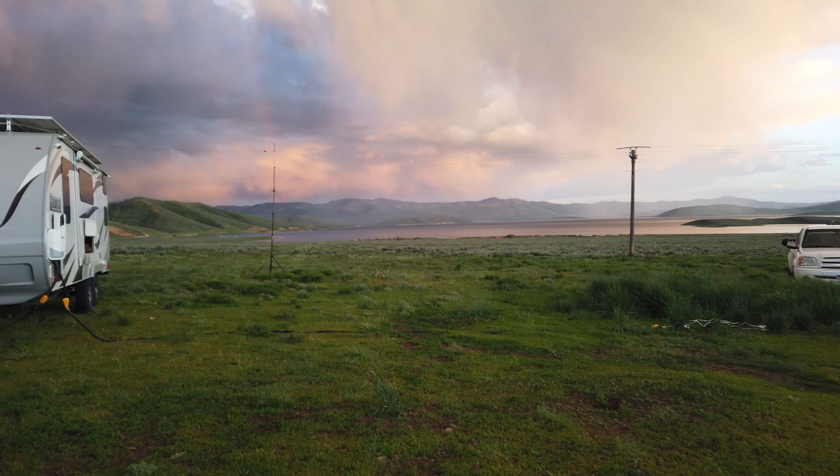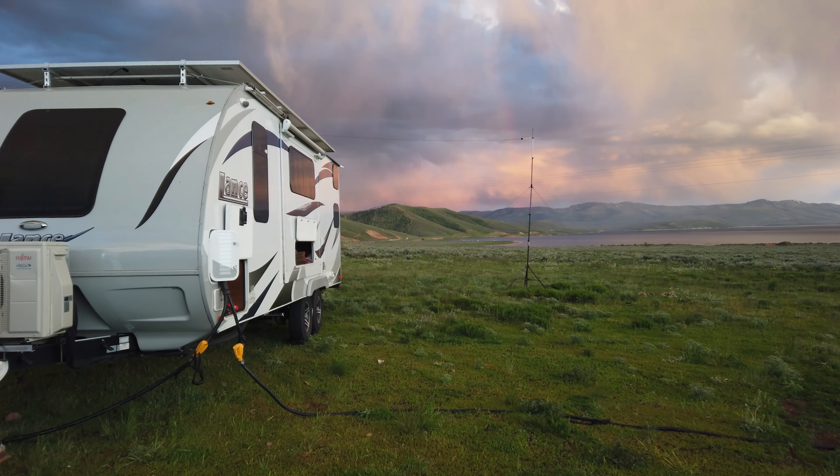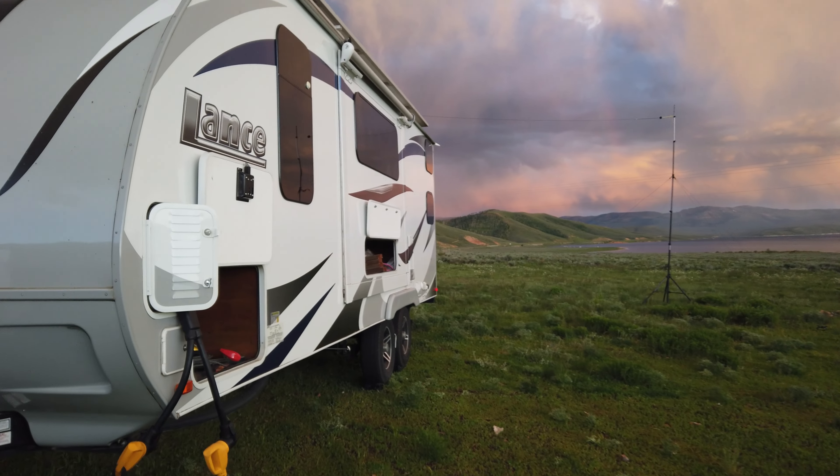Because it doesn't have a battery at all, it requires an AC outlet that can supply up to 500 watts. In our case camping in our RV, we have an easy supply of electricity, so that's no problem. But there's no way to run this kettle from either our Tesla Model S or Model Y, because unfortunately they don't have an AC outlet, and their 12-volt DC power ports can only supply up to 192 watts peak or 144 watts continuous. This would work great with any vehicle that does have a 120-volt standard household outlet. It's technically possible to connect an inverter directly to the 12-volt battery of a vehicle to power this kettle, but I'm not going to test that because I suspect most people wouldn't be willing to do that.